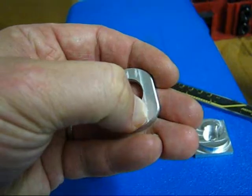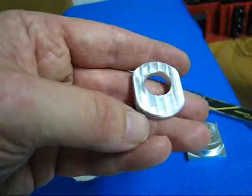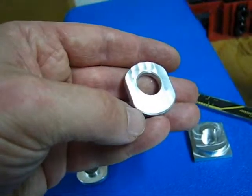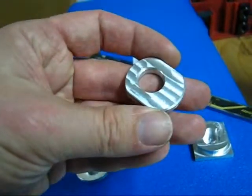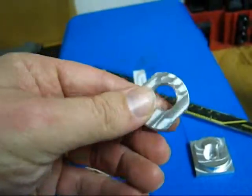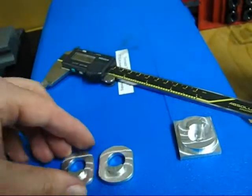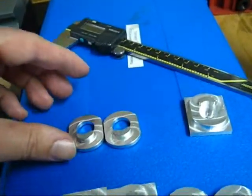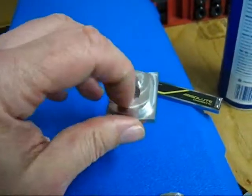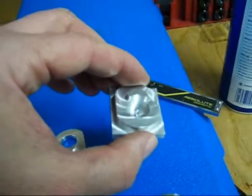There's one groove still on there, but probably down under a thousandth. There are a lot of characteristic marks that tell me there's some flexing of the part going on when it's being machined — some funny effects there. I think that's because of the thin section and how tightly I'm holding the work in the machine. I think that's gone now. I'm working on number three out of the batch right now, and this will be the fourth one to run. The G's were good — it's one of the ones where I got the hole diameter correct after several different versions.